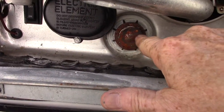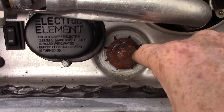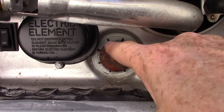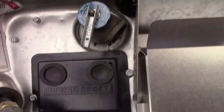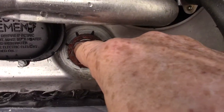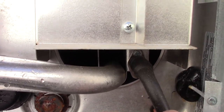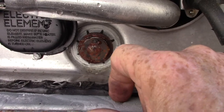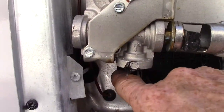This is your drain plug here — it has an anode rod attached to it, about 10 inches long. This takes a 1-and-a-16th inch six-point socket to take it out. And this is a pressure release valve right here. Never release the pressure or pull the plug while the water is hot — you don't want to scald yourself. Always wait until it cools down and always vent it before you take the plug out, otherwise it'll shoot out like a cannonball. The other switches for this are on the inside; I just wanted to show you that the switch in the lower left corner is for the electric heating element.